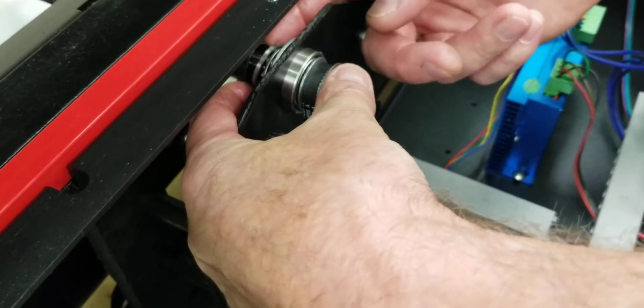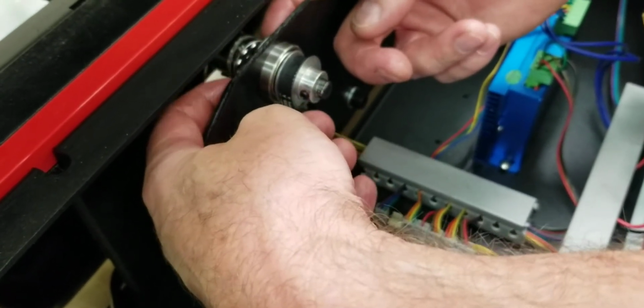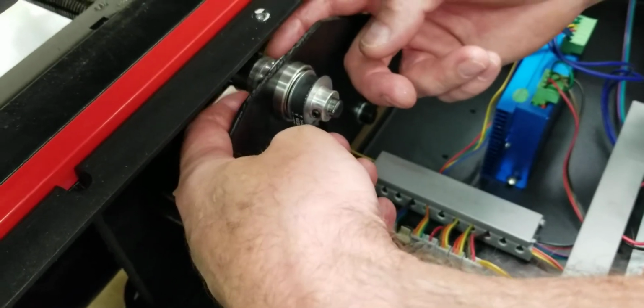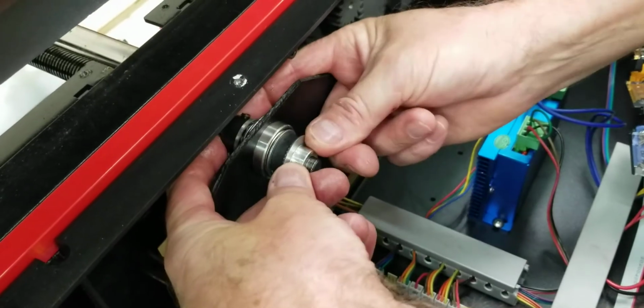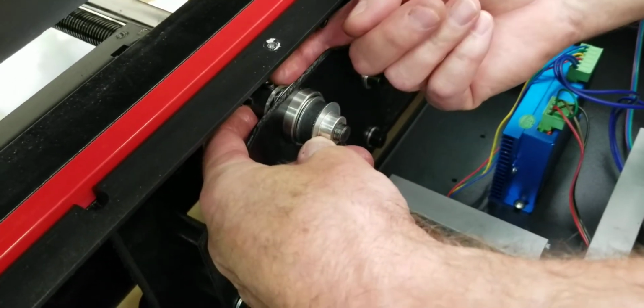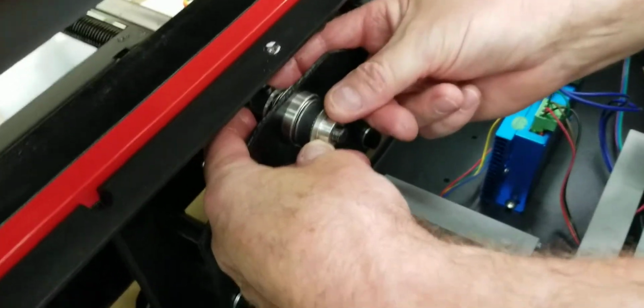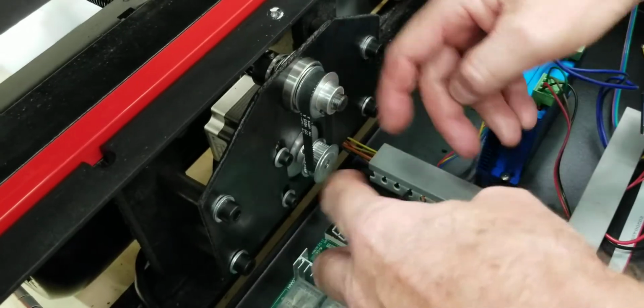It's loose, and there's the bearing here. You can put some grease in these bearings while it's like this. If yours came off like that, just grease it a little bit for good measure. Then you're basically just going to pinch this together, and now there's no play in it. There's a 3mm hex on top and bottom of this clamp, and you just need to tighten them down.